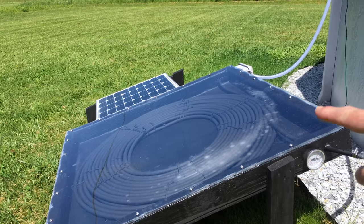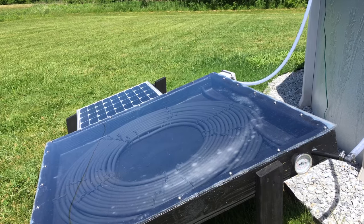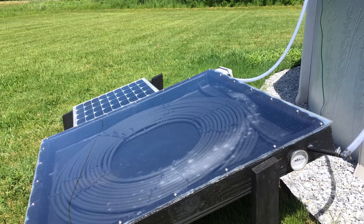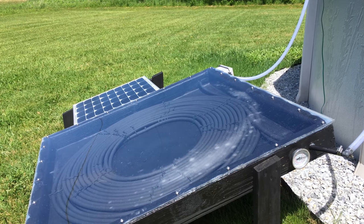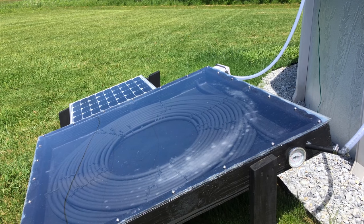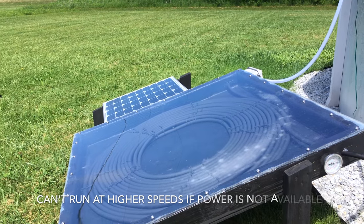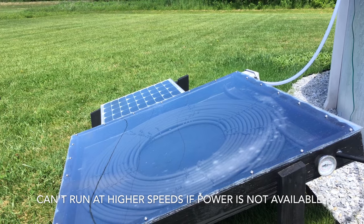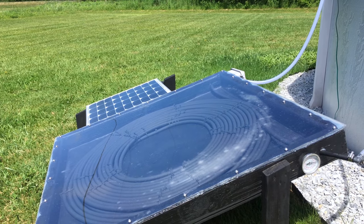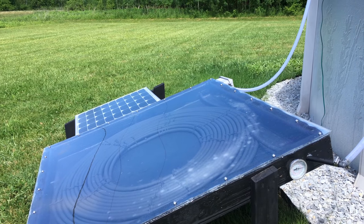As far as the electronic speed control goes, a couple of issues: when actually moving water it takes a lot more power. In previous clips I was running it at 14 volts full and it was only drawing about half an amp. But when actually moving water and working the pump, it takes more like 1.5 amps. Sometimes the system doesn't run because there's not enough amperage from the solar panel. At the bare minimum, you probably don't need the buck boost converter — you could just use the relay and PWM, or even go directly from the solar panel into the PWM speed controller.